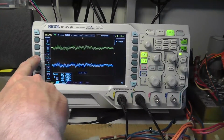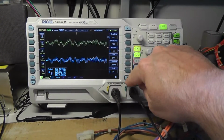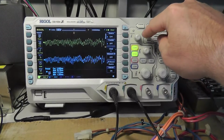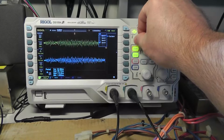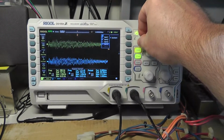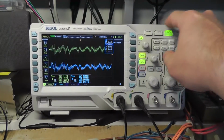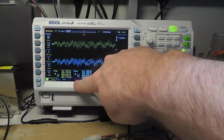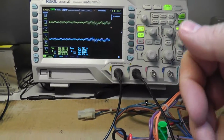So I want to hit frequency, current one, frequency. Oh, shoot. I guess that's not what I wanted to do. Measure. Select item. I want 1, 2, 3. Okay, you can only have 3 items displayed. So we want our 2 frequencies. There we go. So this is basically giving me a minimum frequency and a maximum frequency seen on my channel 1 and channel 2.